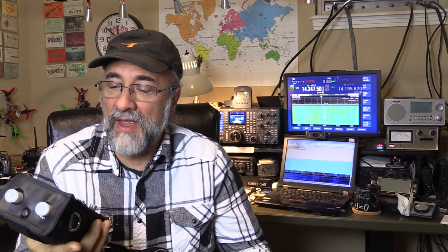In conclusion, this is around the $400 price point right now, probably going to go down in time, but I've seen some sales out there. This doesn't do one thing that the MFJ analyzers do, and that is coax checking — checking the dB loss of an old piece of coax like 9913 at a particular frequency. The MFJ analyzers do that, and there's no easy way to do that here. On the upside, it's got a nice long battery life compared to the MFJ which was always going dead on me. The six double-A's seem to last a lot longer, it's got that really nice plotting screen, and its overall build is just so much better. I do want to warn you there are a lot of reports this doesn't work well in a high RF environment — next to high-power transmitters it can go wacky — but for amateur use it shouldn't be a problem. Two thumbs up from Bob on this one, the Comet, and until next time, take care.